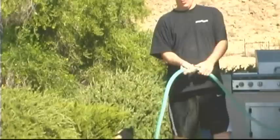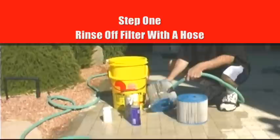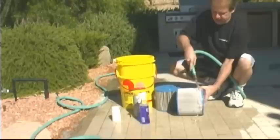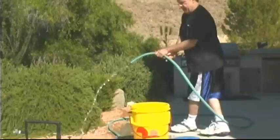What we're going to do is use this hose here. This is actually the water coming out of the spa. You may not want to do that in your situation, but the first thing you want to do is take the filters and just rinse them off a little bit to get any of the ick off of them. These are a little brown, a little gray, but there's not anything like leaves or hair inside of them, which you might find in some spa filters. So I'm just going to give them a little bit of a rinsing.